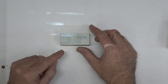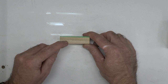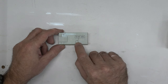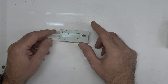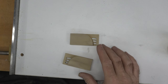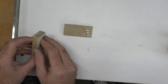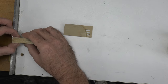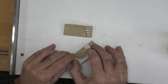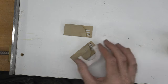Moving on with the core piece — what we have here is a quarter inch stopped hole centered on the three quarter inch thickness. Drill the quarter inch diameter hole and also the five sixteenth diameter hole, then take it to the scroll saw and cut out the center section. With the fender sections dried, use the template, line up the back edge, and trace out the inner cut of the wheel well, then cut it out at the scroll saw.